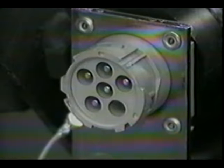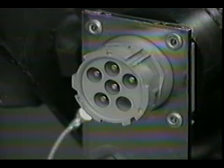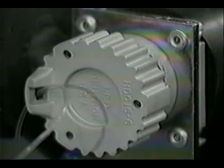A diagnostic tool is available for the standard and 4300 Easy Stop systems. This tool has a built-in switch button and LED. The ECU flashes the LED to show fault codes. The diagnostic tool is attached to the J1587 connector on the diagnostic cable assembly. Though you may leave the tool attached to the connector permanently, it also disconnects readily. Always replace the protective cap when you've completed diagnosis and repairs.